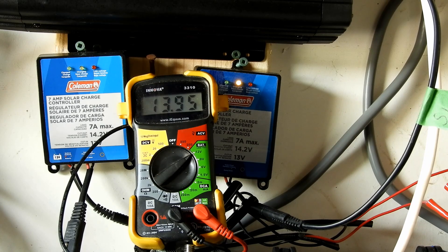Remember, it's a 40 watt panel — it's not putting that much amperage into the battery. I've been noticing it goes up to about 14.5, and you'll see the green light come on — there, it just went on now. So it just went out of charging into a charged mode. Now I can see the voltage dropping down. The controller kicks off and then waits until the battery is below 13 volts normally, then it turns back on and starts charging it up again. The voltage will drop down and it just keeps going through that cycle.